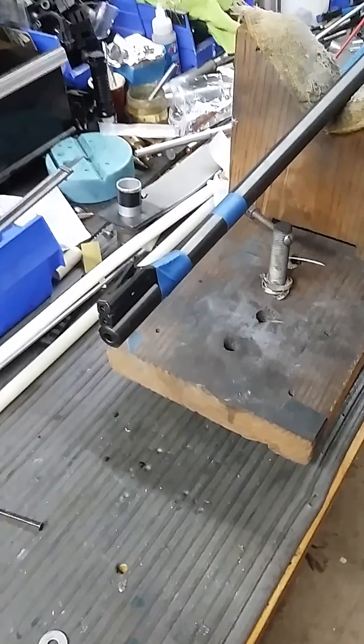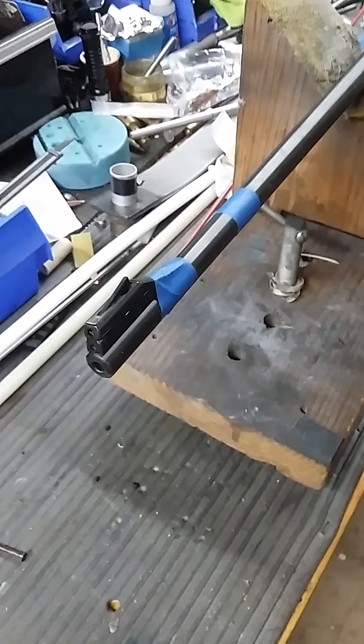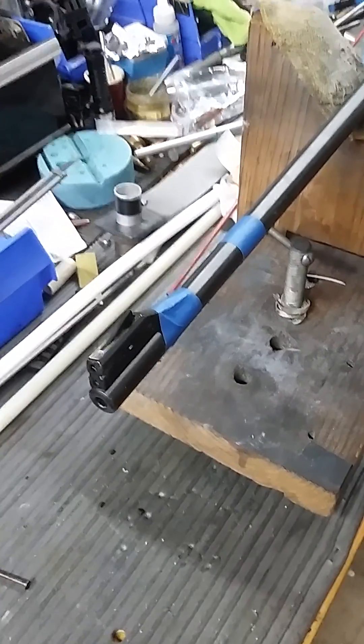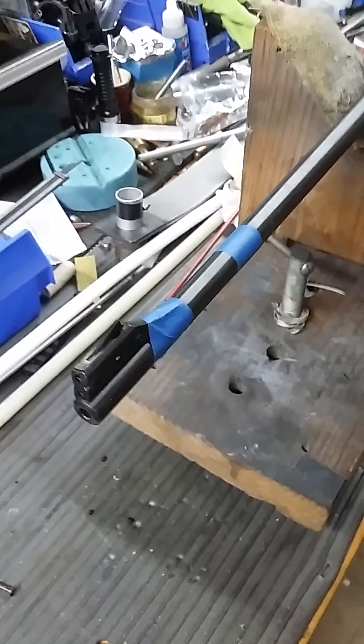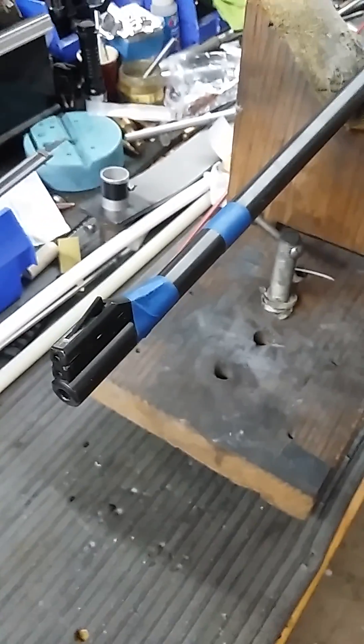I was not able to drive them out with a brass rod, so I'm going to try something I've never done before — to see if we can melt this slug of lead bullets out of this barrel without messing up the bluing on the rifle. We're going to try to heat it in kind of a slow way.